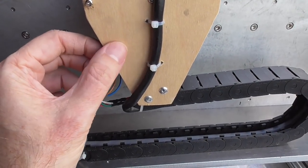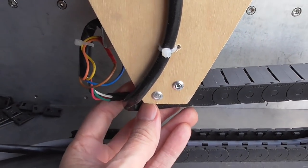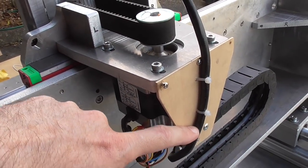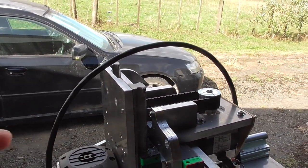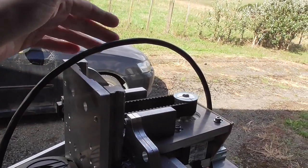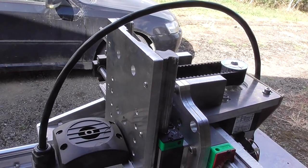There's another drag chain on the X axis with another piece of temporary plywood, all stuck with zip ties — it's a bit flexy but won't be once I put the aluminium one on. At the top, the spindle cable just comes out the top. I did buy a cute little 10 by 10 millimeter drag chain I could have used, but this cable is fairly stiff so I'm just going to leave it — it'll keep itself out of the way well enough.